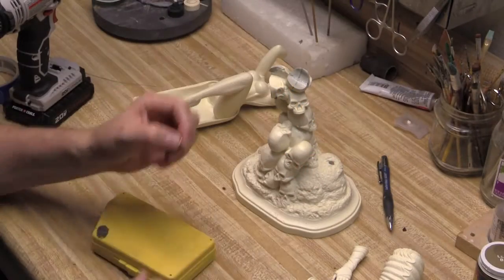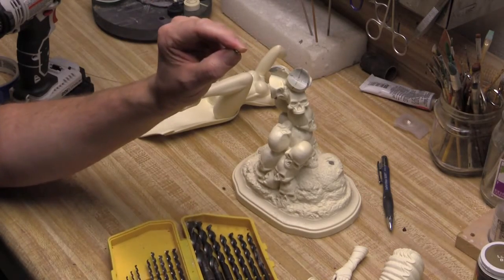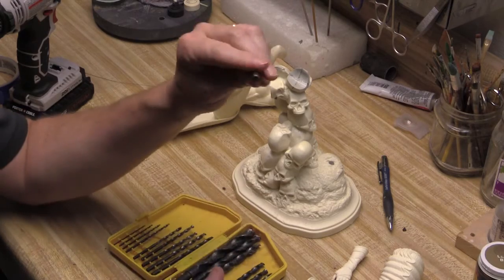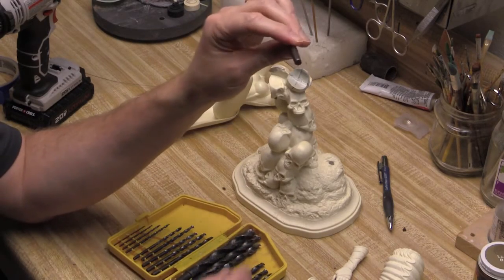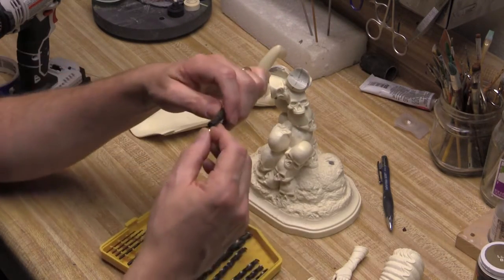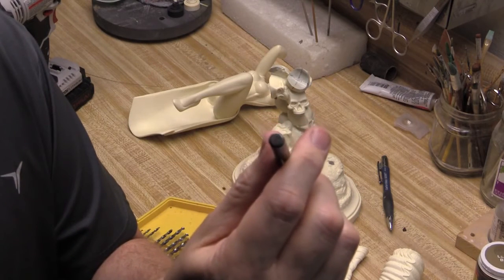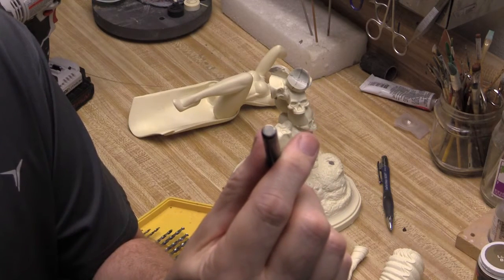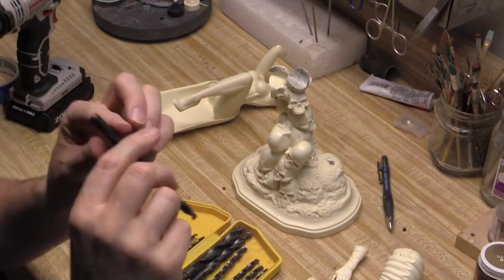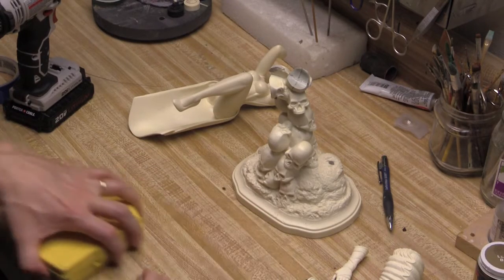Now I want to get a drill bit that's the right size — I want something slightly larger than the magnet I have. The really cool thing is you can set the magnet right on the end of the drill bit and see if it's big enough or too big. Because these are steel rods, the magnet sticks right to it. This appears like it's going to work — the black of the drill bit is a little bit larger than the silver of the magnet. I don't want to go so large I start breaking up the piece, but I need it large enough to give myself a little wiggle room for the magnet.